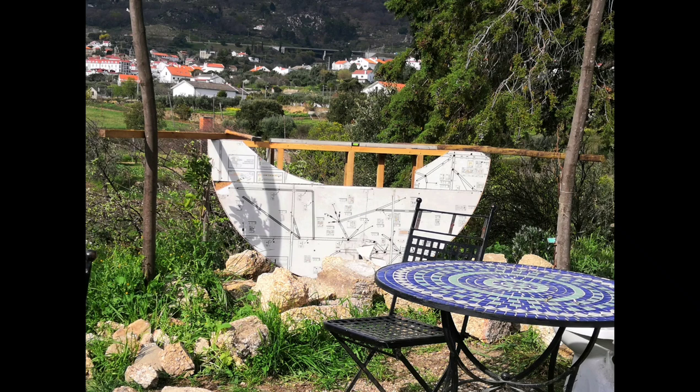The formwork you see in this picture I made from some chipboard with a nice laminate on, which we found at the property, so it's virtually cost free. I cut the circle with a jigsaw, marked it out properly, and then on the edge of the formwork, we used some thin ply just to stop any ingress of the mortar used. We later reused the formwork to create the circle for the mosaic.